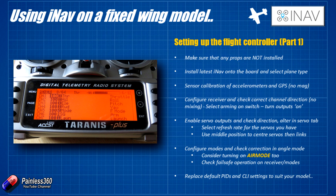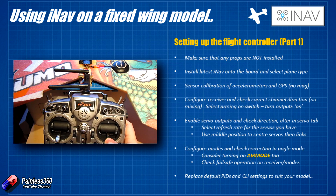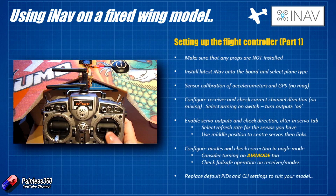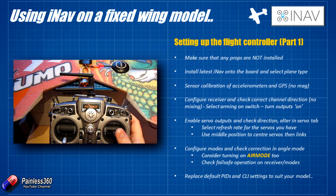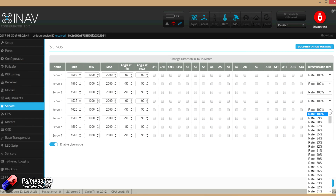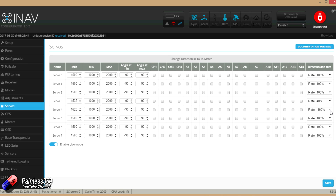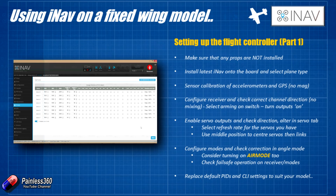Once we've got to that stage, we're pretty much ready to put the battery in, and once we've got the battery in it should start to move the servos around. We need to move the elevator and aileron side to side and make sure that each of the servos and outputs are moving in the correct direction. Typically one of ours wasn't, so we went into the servo tab and on the right-hand side clicked the reverse servo. We have rates here: 100 is one direction, minus 100 is the other. We also found the throws were much larger than needed — on a TechSumo I'm only after about 15mm of throw for both elevator and aileron — so I dialed back those rates from 100/-100 to numbers that gave me exactly the 15mm throw needed for the model.